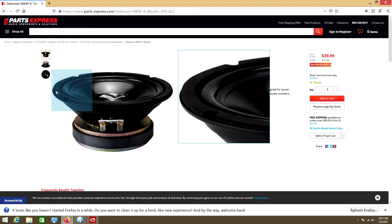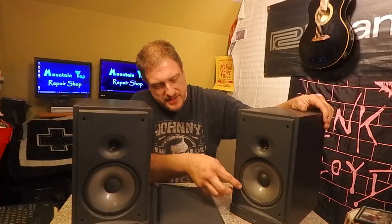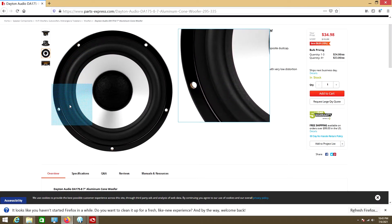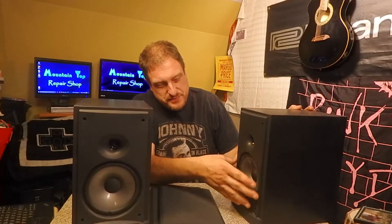I was ready to get myself some new woofers. All the speakers I was looking at that actually fit the bill had foam on the front and I felt it was just going to be visible right around this edge — you might even see the screws. So when I went into a seven-inch speaker I found one that actually looks beautiful behind this face, but we're going to have to make some modifications on the inside. The baffle cutout needs to be a little bigger and I'm going to hide the thickness of that new speaker with a little foam, bringing the whole face out maybe an eighth of an inch. We also have to take everything out because there's going to be a lot of sawdust with this adjustment.